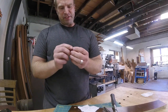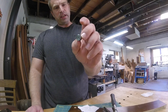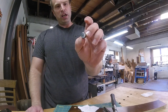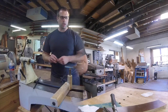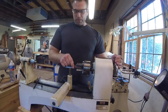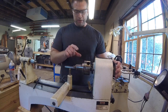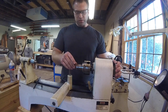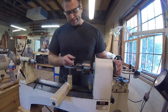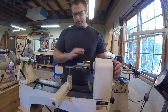Now we have this little piece with the hole in the insert, and that's what we'll be turning a custom finial to match. I have a pen blank here — a piece of walnut chucked up in my Nova G3 with my Pens Plus Jaws that I also use for drilling out pen blanks. Just a pen blank size piece of wood, three quarters of an inch. You can even use something smaller because we're going to turn it way down.